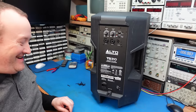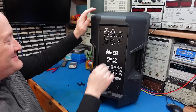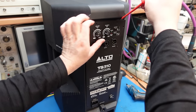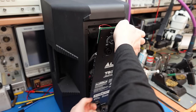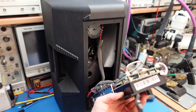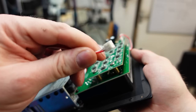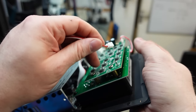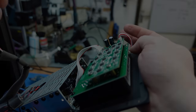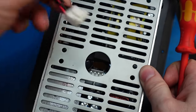The last screw. Oh, just pulled the knob off — it's supposed to come out. Always a pain. As soon as you have to tease this off a bit — oh, that's not been too bad this time. Reveal all the electronics behind there. You have to cut these cable ties off here, disconnect this LED. Oh, it took the plug off — oh, the quality of these things. The plug down in the amplifier, just pull that up. There we go, and we're free.